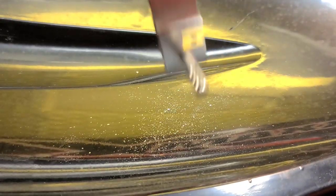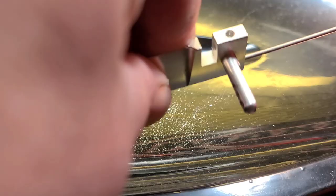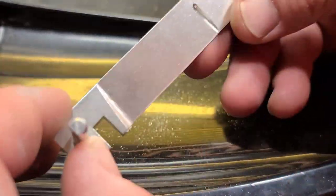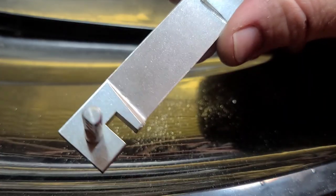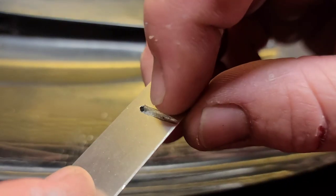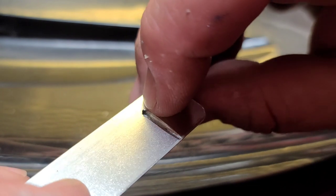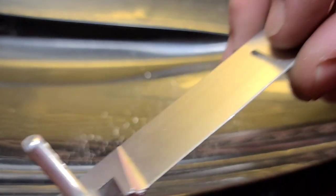I'm just showing you guys this — I've got a long enough drill bit, I'm just showing you this trick: how to open it up without a drill bit. So I'm just slowly opening up the passageway without drilling out the threads. I think that's gonna be good. Now we're just gonna get a drill bit and kind of open this hole right here up just a hair — you don't want to cut that little lip off, just want to kind of open it up a little bit.